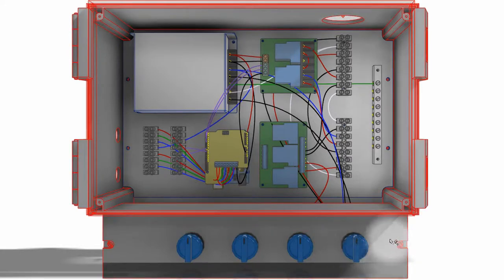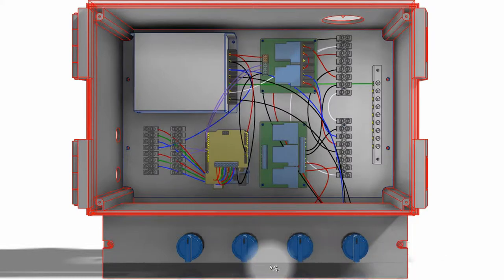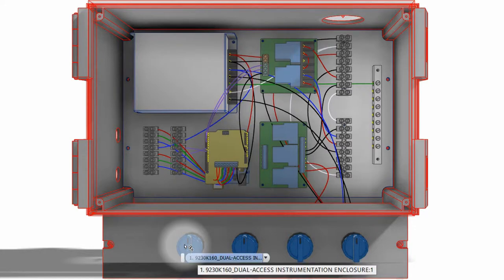Finally, we have the industrial control switches. The first one powers the control box itself and locks out AC power to the rest of the switches, so you can't really have the pump on without the control system on. The second switch turns on the circulation pump. The third switch is the priming switch, which turns on the vacuum for vacuum priming. And the final switch is the ozonator switch, which turns on the hardwired ozone generator.